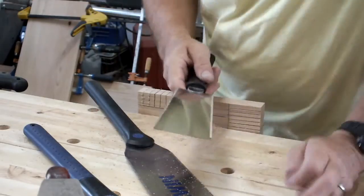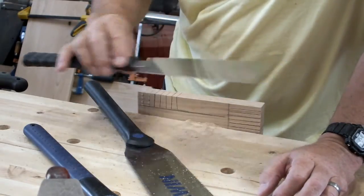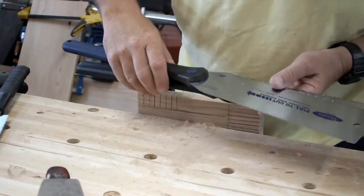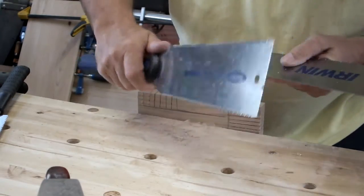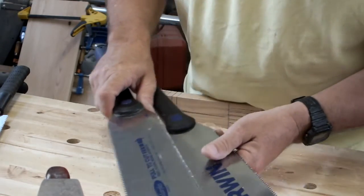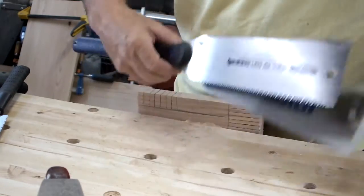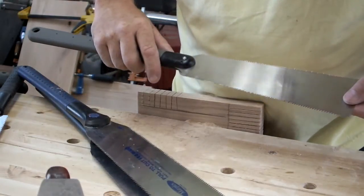And if you're looking for something in the shop for joinery, this is a real consideration. These I'm not so pleased with because of the ripping performance, the vibration, the shake, the aggressiveness of the teeth. Does that make it a good joinery saw? Well, no, because 50% of your joinery is ripping. The other 50% is cross-cut. These do fine. This does fine in both.